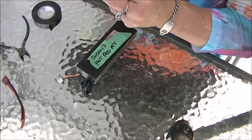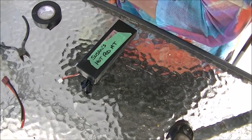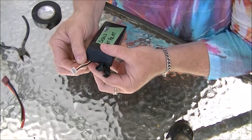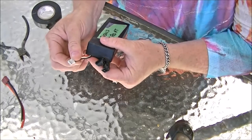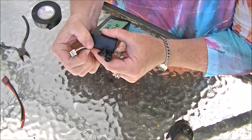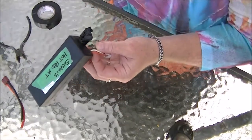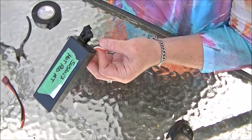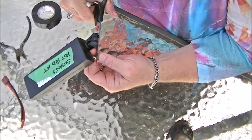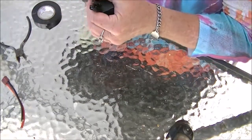I'm going to prep some tape for the other three leads and it's the same deal with these — they carry the same kind of energy output. This is the positive, this is the positive for the other cell, and this is the negative for both. So again we start with the negative, go up a little bit. There we go. Now need to seal that.